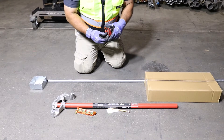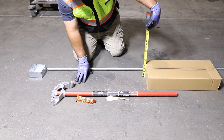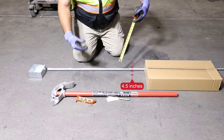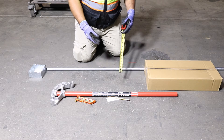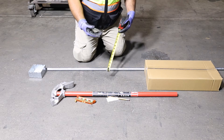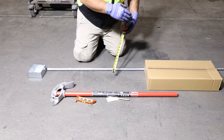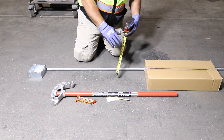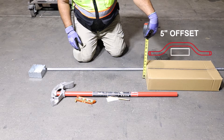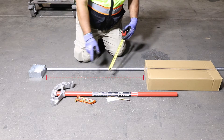That's a piece of information we know. Now we know how far up we're going to go. This obstruction is four and a half inches tall, but let's just call it five inches. There's no reason to go half or quarter when we're trying to jump over something — give it enough room. We want it to stay away from it. So let's call this a five-inch offset, five-inch four-point saddle starting at 36 inches.